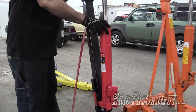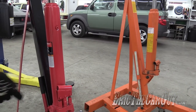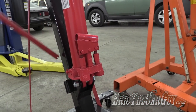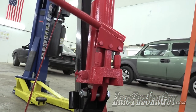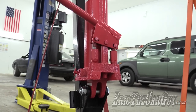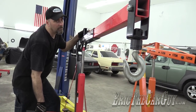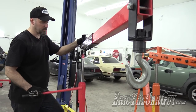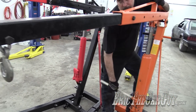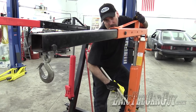The cylinders are almost virtually the same between the two. There are very few differences, except the SunX has a dual pump cylinder, so it pumps up twice as fast as the Harbor Freight, because as you're going down, you're also going up — every time you move the lever, the boom is going up. This means it'll lift much more quickly. The Harbor Freight does have a longer stroke, but each time you move the lever on the SunX, it's going up.